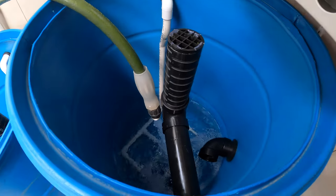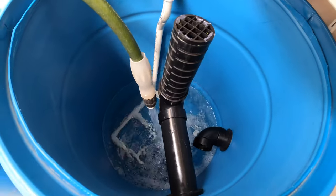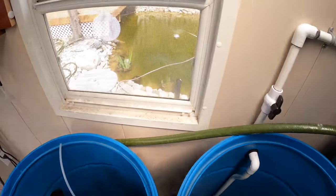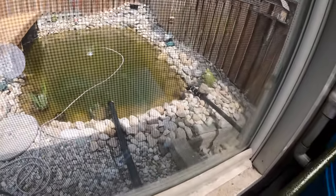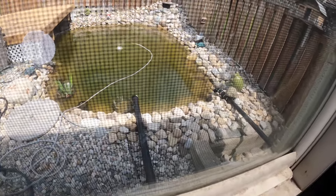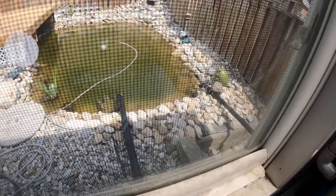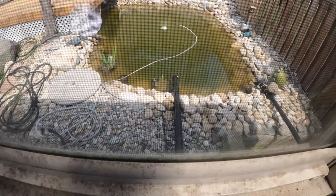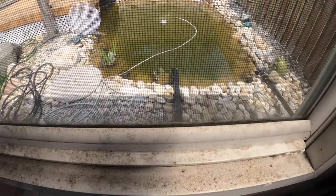Now I'm going to run the water test. I'm just using the garden hose to do the test because it is still cold outside and the fish are still hibernating at the bottom — I don't want to disturb them yet, so I haven't dropped the pump down to the pond yet. On the right side that's a 1.5-inch pipe — my pump will hook up there to bring water into the system. On the left side is a 2-inch pipe going down to the pond — that's my outlet, water coming out from the filter system and back to the pond.